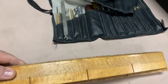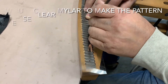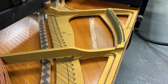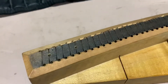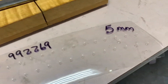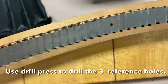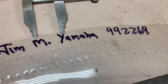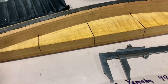I'll show you the whole process as I go. The cap is referenced and measured before it comes out of the piano, then we bring it to the bench and make a pattern for the cap. These tools are for measuring the cap, its thickness, and its positioning. The holes on top reference and ensure the cap will be put back in exactly the same position.